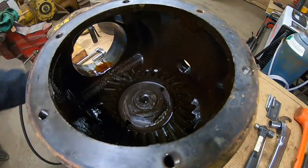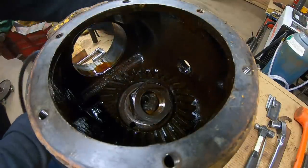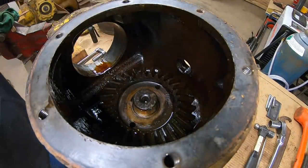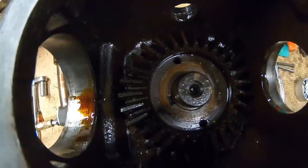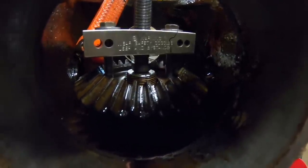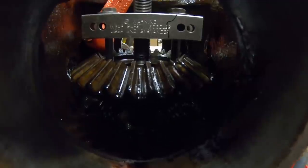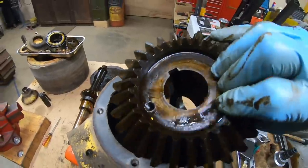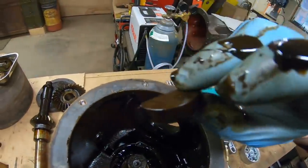Okay, input shaft and gear is all that is left. Lock has been folded flat. Same nut that holds the pulley on. And the fold over lock. The gear has to pull off next, and thankfully they provided us with two threaded pulling holes. Gear out. And woodruff key.